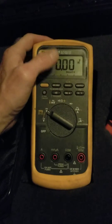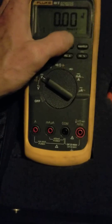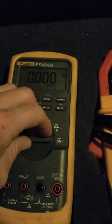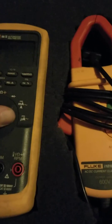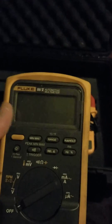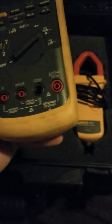This is a very accurate, auto-ranging meter, so it can match the voltage on its own. But it also has a manual mode where you can set it to six volts to pick up the finest readings. It also has a backlight, and you can use the minimum/maximum feature — so say you go to your car to test the starter and you're able to see the minimum and maximum values even when you're not standing at the multimeter.